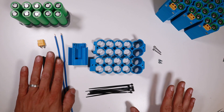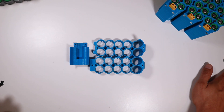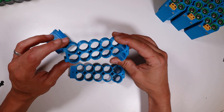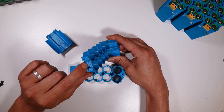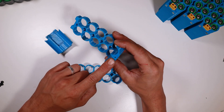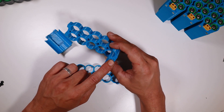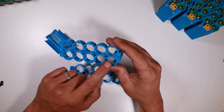Let's start building this and give ourselves some room. Before I can actually construct it, I always prefer to prepare the parts first. This part is made for the XT60 connector — it goes in here — but there's a little bit of support I have to cut out. The holes need to be 2.6 millimeters so I'm going to use a drill to make sure it's the exact diameter. It's printed with support so I have to clear that out.